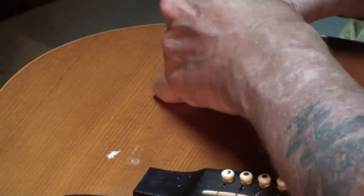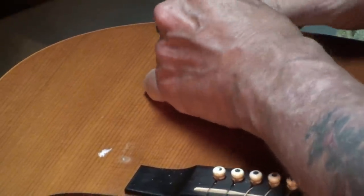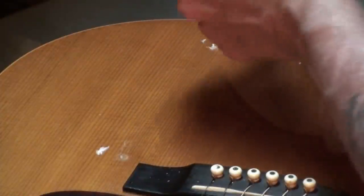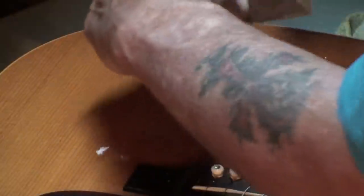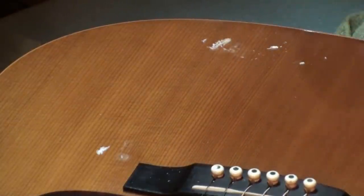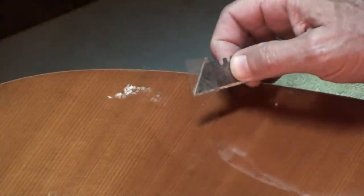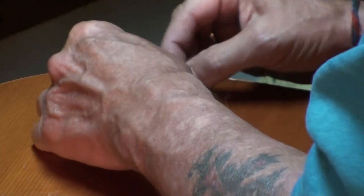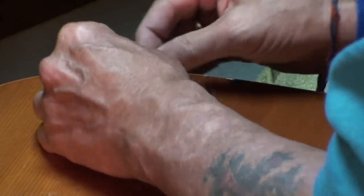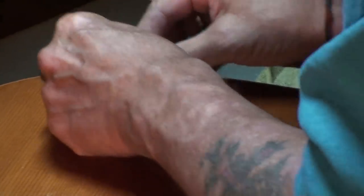Let's get this other one. I'm not finished so far — it's really cutting in there. If you put a burr on the end of your razor blade like I did here and you want to slice, turn the blade sideways — don't scrape straight across. Turn your blade sideways a little bit and it slices through it. Instead of going straight across with a burr, turn your blade a little bit sideways to the direction you're scraping and it slices through that, like a snow plow on snow. That's the best way I can put it. I think this one's done — still got to buff that of course.